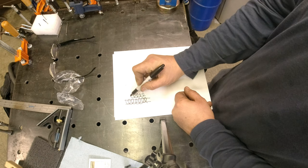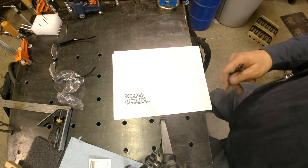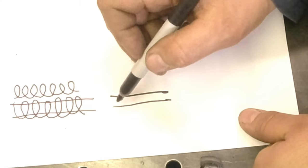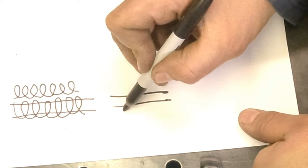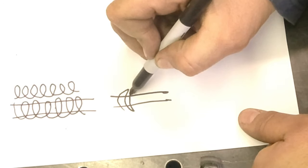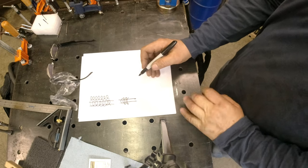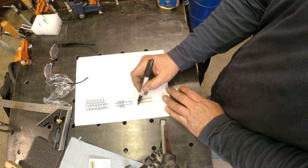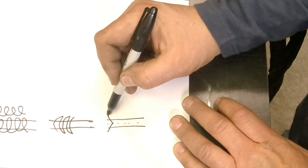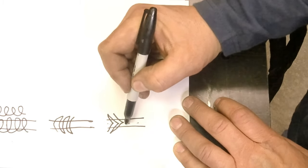I've got people who tell me you should only push, and people who tell me you should only pull — I think that really just depends on training. The next pattern is just back and forth, from here to here. You stop for a second on the outside edges and let it penetrate. The third is where you imagine a line down the center — you're driving the wire in and out, pushing the wire down into the root valley.